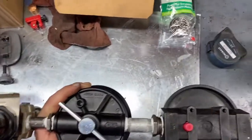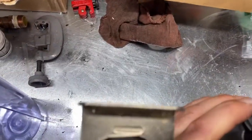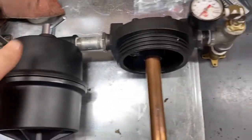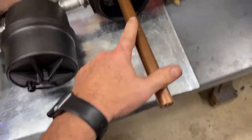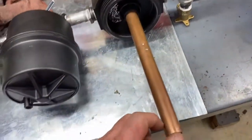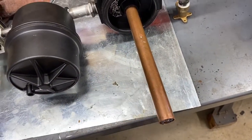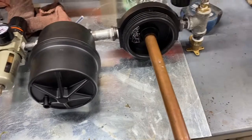Next I need to add the desiccant beads to the dryer and then mount this to the wall. There will be three mounting screws in my PEX fitting that will hold up the right side, and there is a bracket on my regulator that will hold up the left side. The left side is a little bit farther from the wall, so I think I'll need to add a spacer between that bracket and the wall so that it sits parallel. Next task is to pour in the desiccant beads and screw this on.